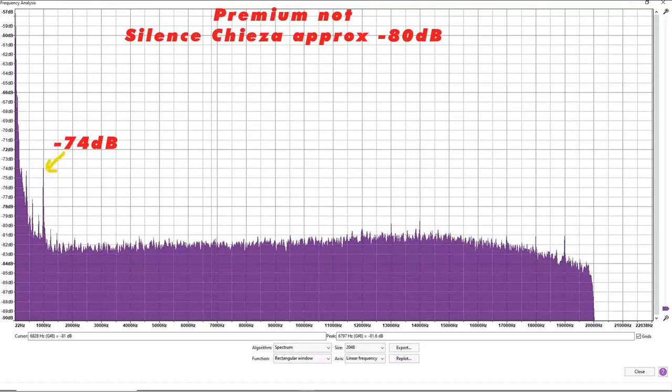Listen to all that. Now let's have a look at the silence. When you look at the silence on this, you can see this is what silence should be. This is a Type 1 obviously and it's averaging at about minus 80 dB on the silence. There is a little bit of print-through though on the minus 74 dB, which I think is because it's 100. The last time I used 100 I also got a little bit of print-through, but I got a lot more than that.